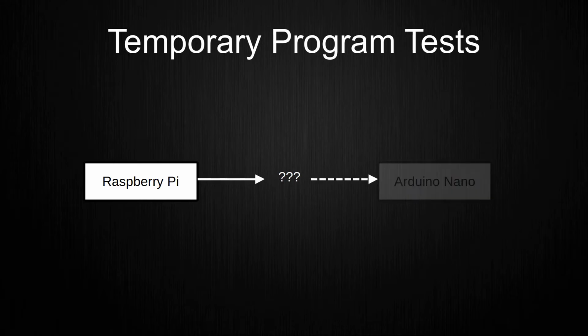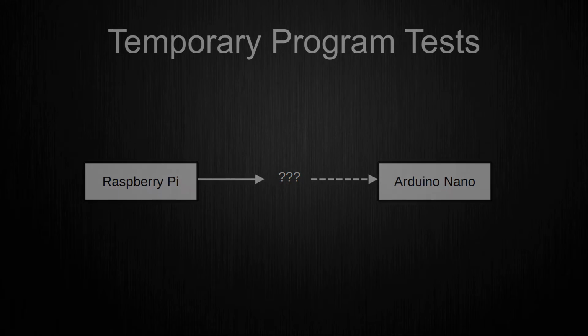The last test phase was for completing the temporary program of the Raspberry Pi and the body program. Here, I went through all dialog options and verified their behavior. After some debugging, I finally got it to work to a state where it is usable. I noticed during the first long-term tests that the communication between the Raspberry Pi and the body microcontroller breaks down at some point, and the Raspberry Pi gets caught in an endless cycle of sending data to the microcontroller, each time without any response from the microcontroller.